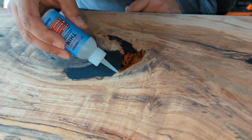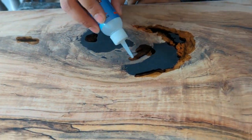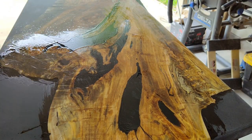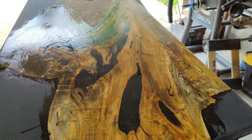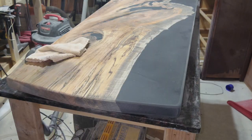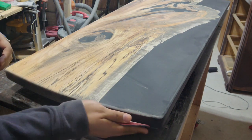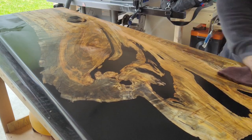And because I really must love sanding, but more importantly because I'm paranoid that even after the epoxy I was going to have some soft areas of wood, I added a thin coat of CA glue — and more time sanding. More importantly, ensuring that I wouldn't have to refinish this table for a fourth time. Now that I'm done with all those enjoyable steps, I get to do more sanding, working all the way up to 240 grit while water popping the surface between grits.